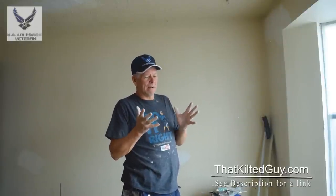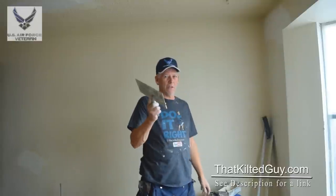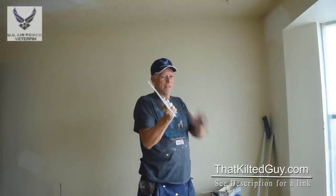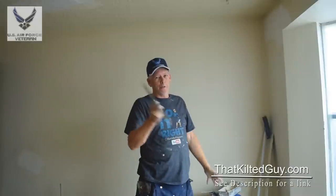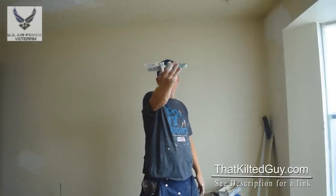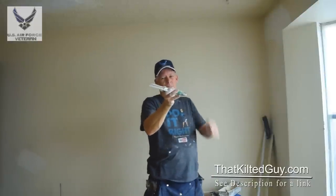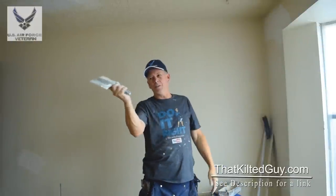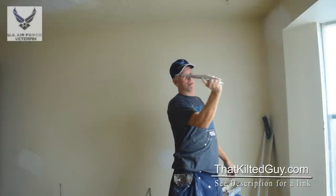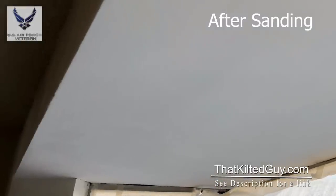The secret is practice with your knife. These bigger knives take more effort — they look easy to run but you actually have to push pretty hard to get that mud to spread out. If it feels like it's breaking up behind you and not spreading right, push harder. Keep your knife at about a 30 to 40 degree angle — you start out steeper and as you go, you lay your knife down. So it starts steep and then spreads out more and more. It's just a lot of practice. If you do much skim coating, coat about one wall and you'll probably find you get a whole lot better.